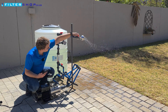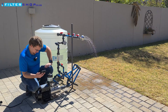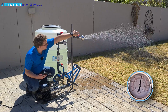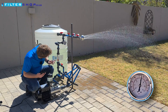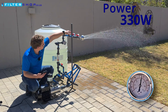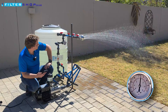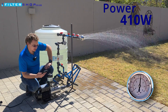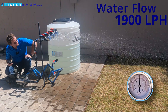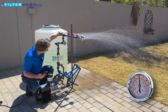At 3 bar pressure with only a small load, we had 250 watts — not bad for full 3 bar. With a single shower running, we are now doing about 650 liters per hour and drawing 330 watts. Adding the second shower, it's very quick to respond with only a very quick dip in pressure. We're now at 410 watts for two showers. Adding the third shower, we are at 1,900 liters per hour drawing 520 watts. Still at 3 bar, very efficient power consumption wise.